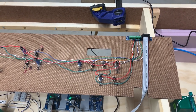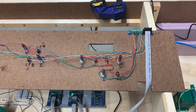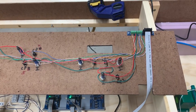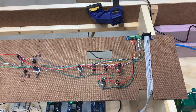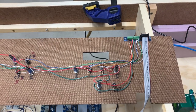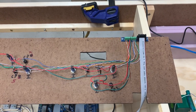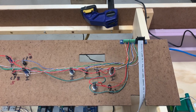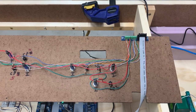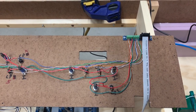And so I thought for a while it was a result of not having my resistance correct between the push button and the LED, because there's a kind of a magic number. You have to have no less than 3.5 volts on one side of the push button and no more than 0.08 volts on the other side, because you have to configure the node in the computer to recognize a difference between those two values. And if you don't have the right difference in there, then it will always either be high or be low.